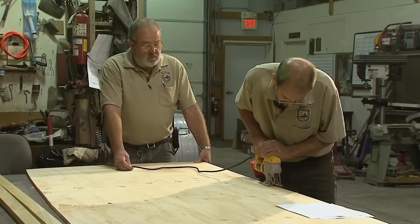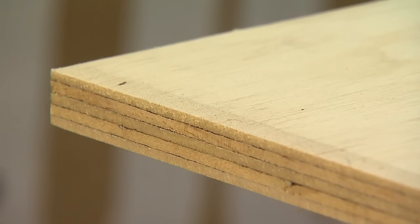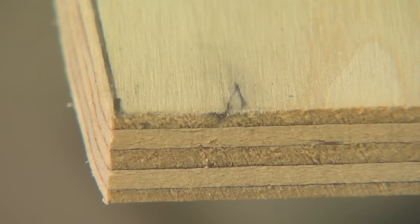There's a reason you use marine-grade plywood. If you're just using cheap plywood, you might have a problem. This particular plywood is 5/8ths — it's a top-grade ply, individually plied with a very good exterior glue. They use a thicker ply to give it a better density and a better bonding.